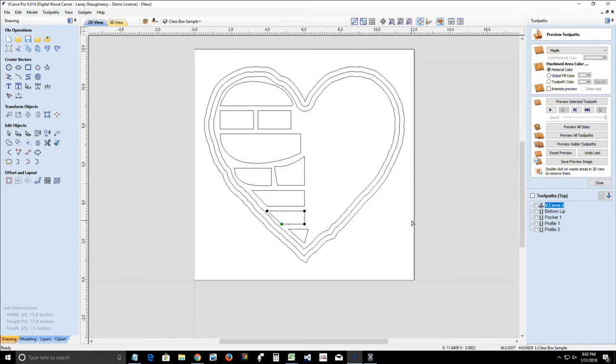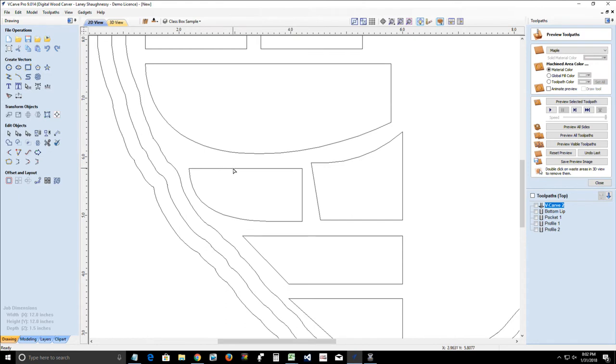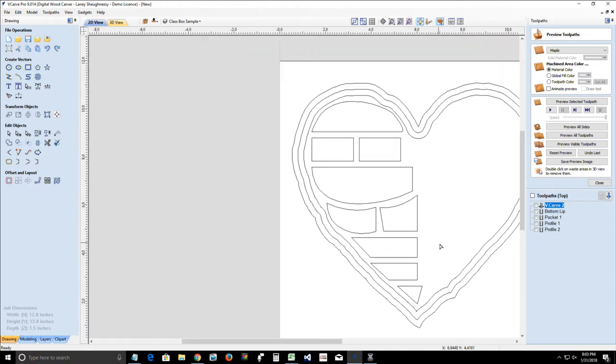And let's look at this half of this segment. I want this to be curved all the way around. So this guy here, let's go ahead and select him. If I go into node editing mode, I can snap that node to there. I'm going to pull this guy up right into here, fill that void, and I'm going to turn this into an arc, and pull that arc down to somewhat follow that curve. And again, I'm going to pull this one back. Something like that. All right.